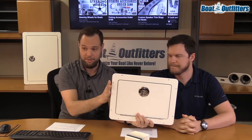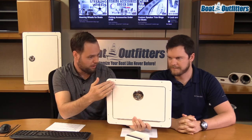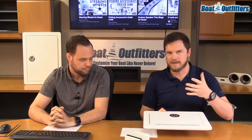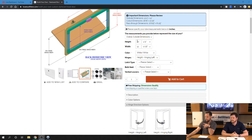It's really important to hinge on the long dimension, especially when the door is wider than it is tall. If you hinge on the short side, the weight of the starboard will cause the door to sag inside the frame, and the bottom of the door will actually hit the frame when you try to close it. You get clearance issues in the reveal. The shorter hinge gives you less support with more leverage — and plastic will give a little under load.